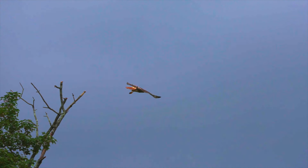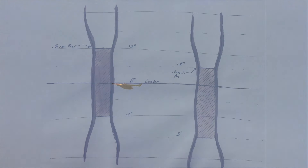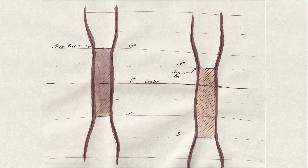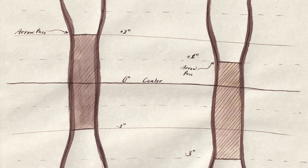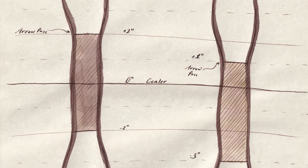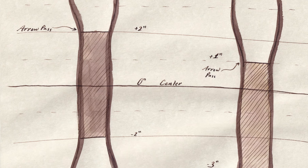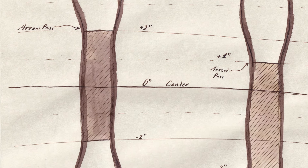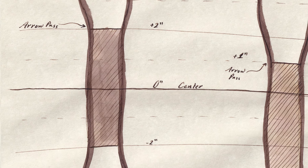Go with whatever you feel comfortable with. Here's a typical handle layout for a symmetrical bow: the grip is 4 inches long, and the fades are 2 inches long on either side. The arrow pass goes at the top of the grip, 2 inches above the center — so the arrow pass is pretty far off center. The pressure point of the grip ends up being above the center, which also gives this design a pretty bottom-heavy feeling.